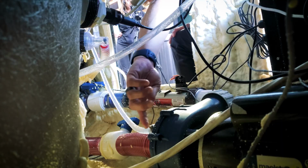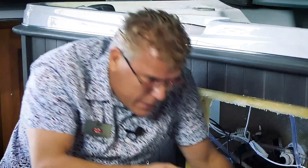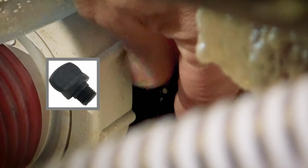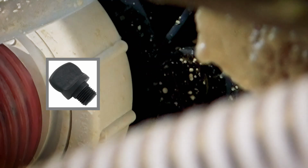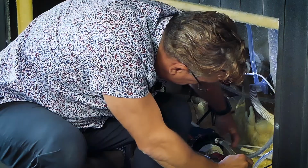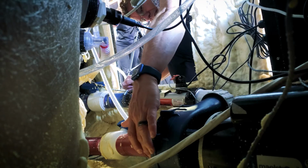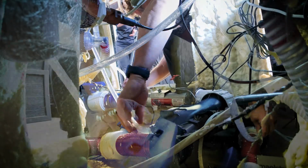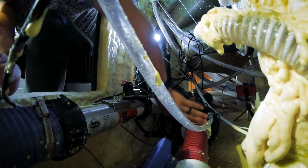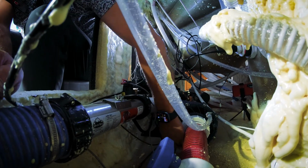So on any pump, if you look closely, they'll usually have a little key piece that fits in there. It's got a little wing nut sort of thing that you can turn, and that's a bleed valve. When they say bleed, it means we can bleed off the air from this area here. The nice thing about a custom series spa is we've taken one of these out and put in a self-bleeding system. This is at the upper half of the wet end because the air tends to be on the top, not on the bottom.